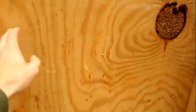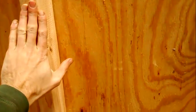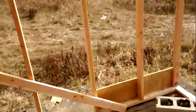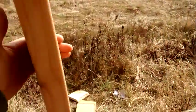So it should be pretty nice and toasty warm in here when we're all done. I'm going to put a poly liner wrapped around the 2x4s across here just to make that airtight. And then I'm going to put a reflective insulation barrier across that so you have the reflection, a little bit of insulation, an air gap, and then a little bit of R-value. On the exterior I'm going to get greenhouse poly put on, and then an interior layer of poly.